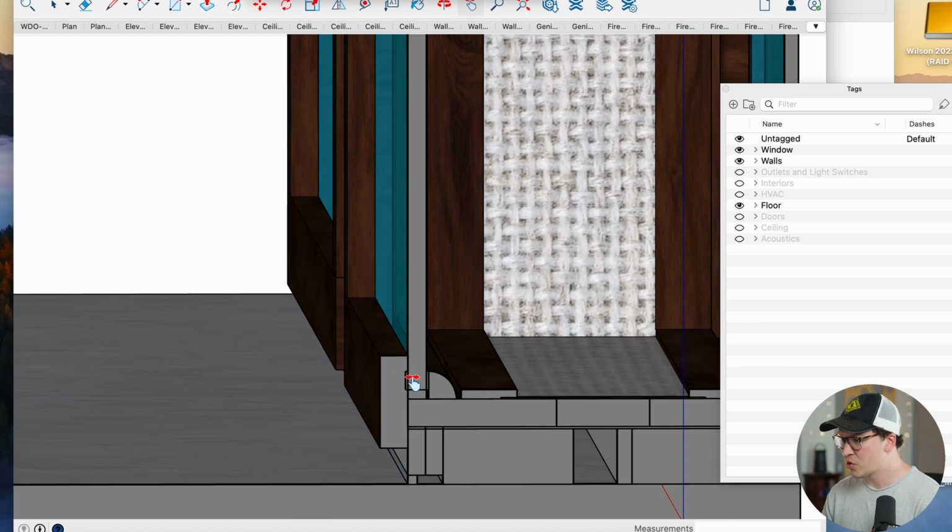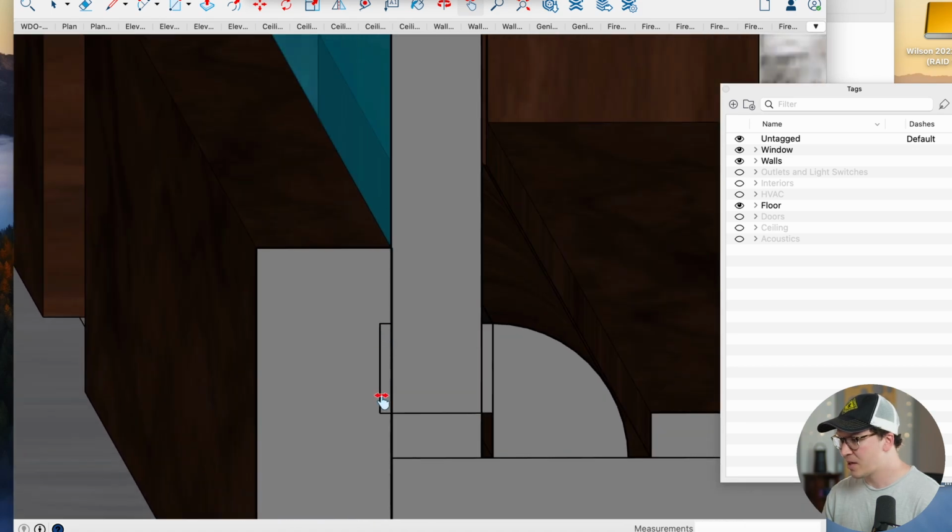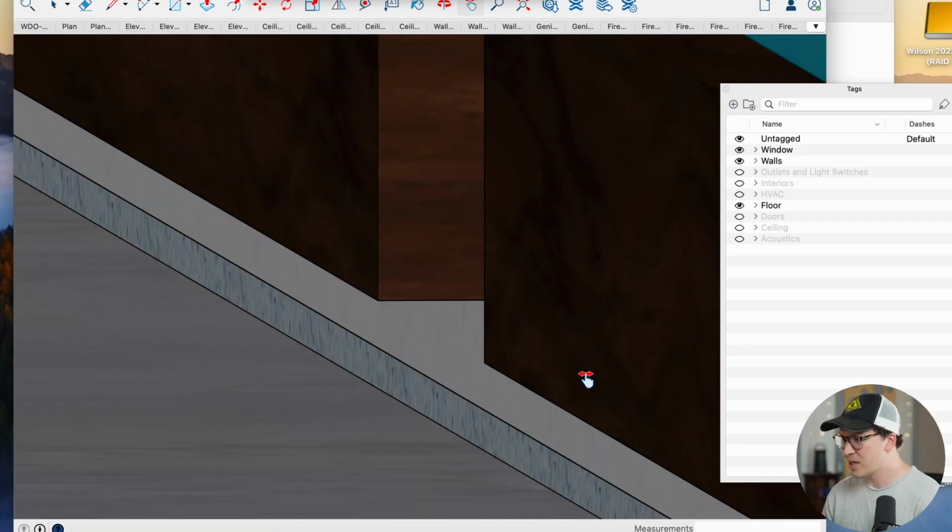And then we've got window trim. We've got this right here, which is the glazing tape that goes all the way around the window. And then we've got the actual window itself. And then this right here is just a little piece of rubber that the window sits on, and we run that rubber all the way around all four sides of the window. And then this is your quarter round wood stop that holds everything in place.